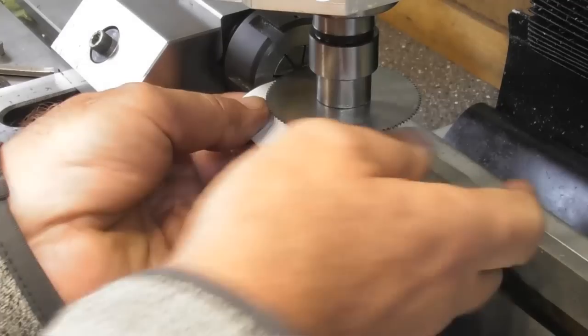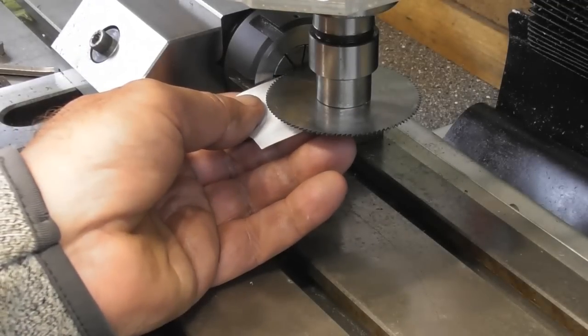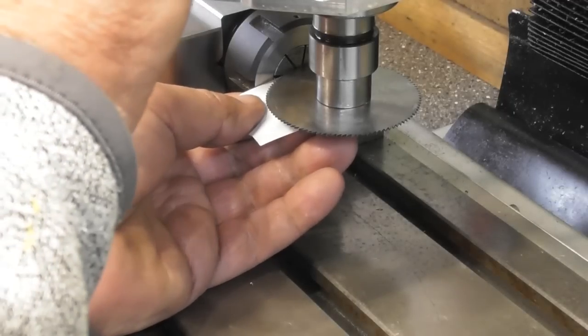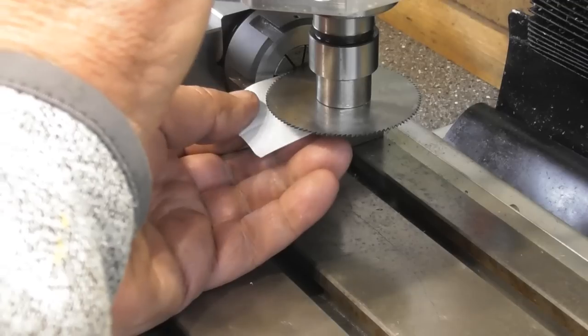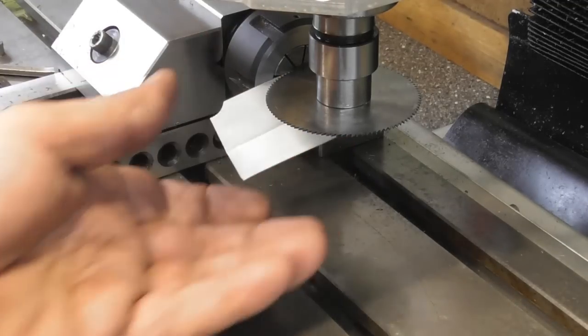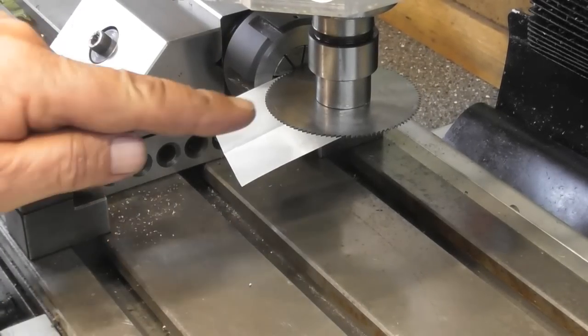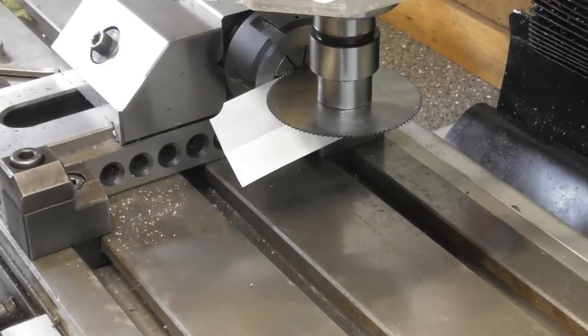So I've got a cigarette paper. Let me just bring that over a touch closer to the chuck. Moving. That's just dragging in there. That's a thousandth of an inch. So that's touching on top of the pin. I'll move it along. Let me just set a 0.